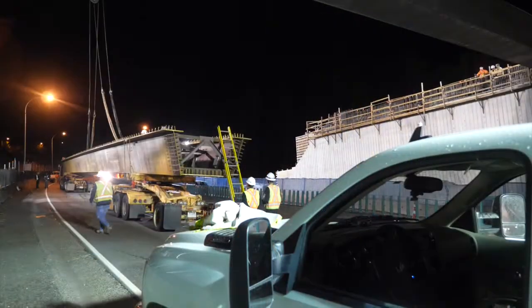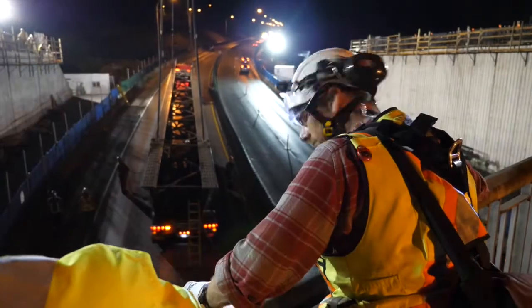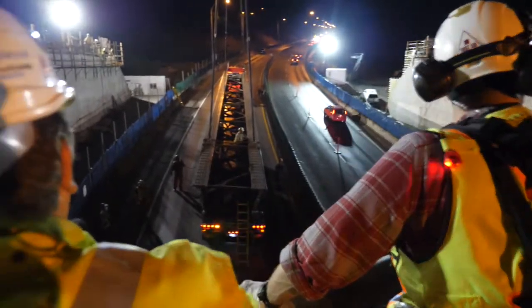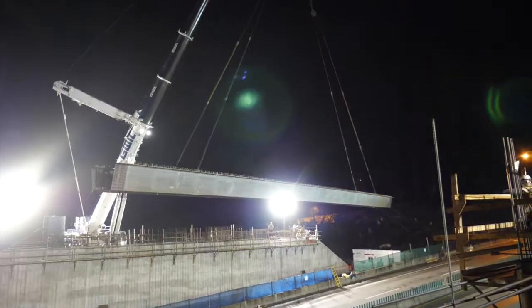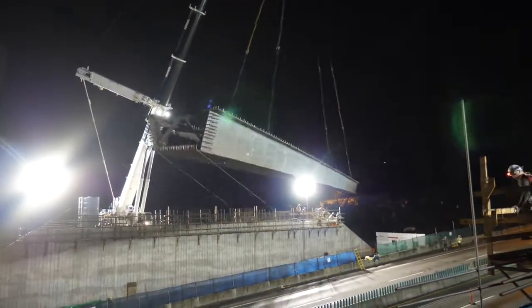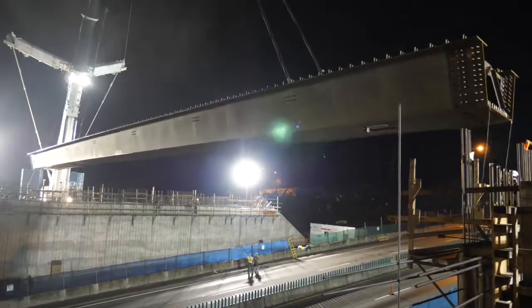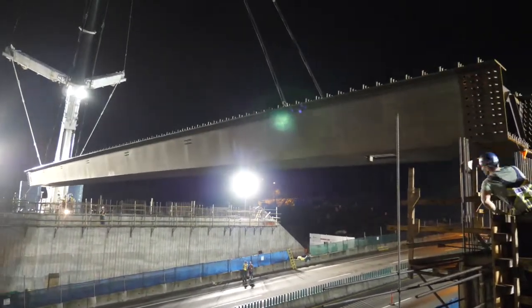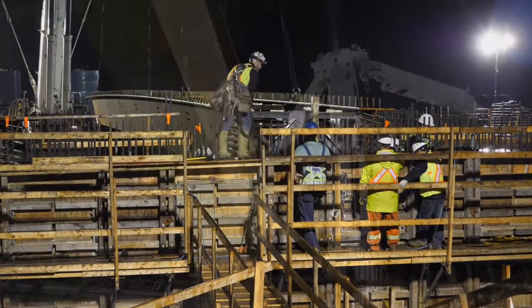On the first night the main thing we were looking at is how the girders are going to move. We were on a little bit of a grade outside, so a little bit of steepness in the road. We weren't sure how the girders were going to travel, so we took a little more time — especially on the first one — making slow movements with the crane until you get everything set. The first girder probably takes about an hour longer than the rest, but when you're doing a heavy lift like this, slow and steady wins the day.